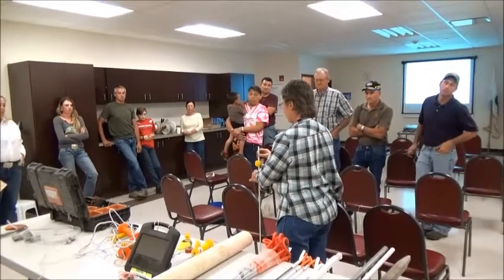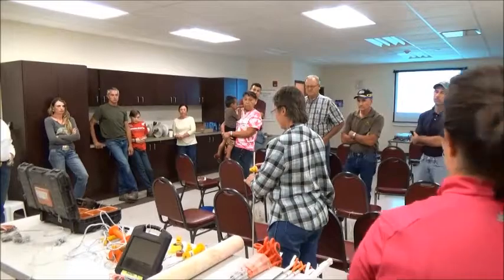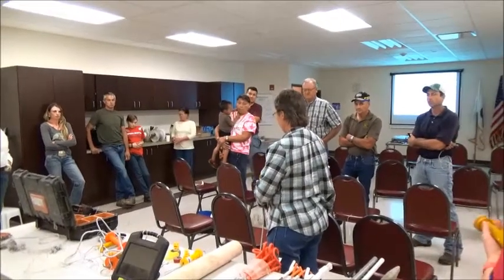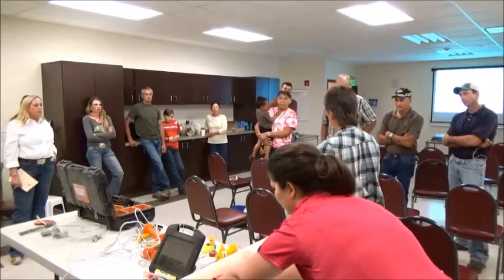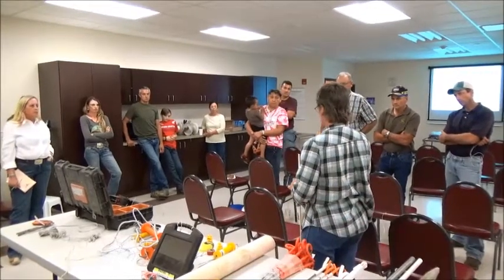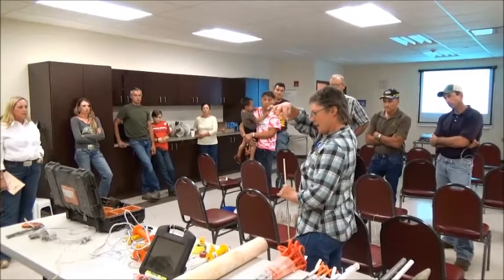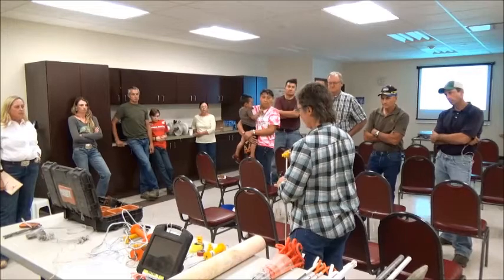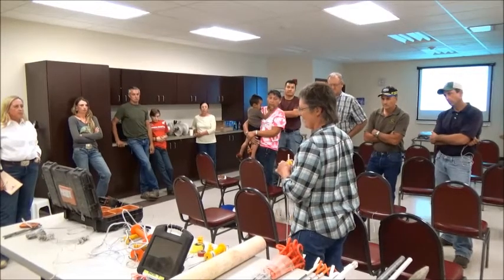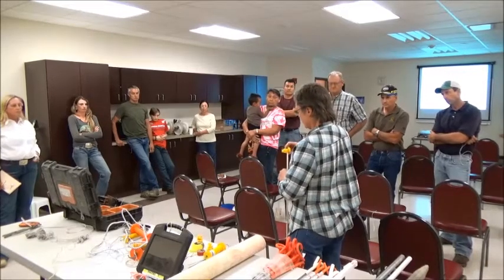This post will put fiberglass slivers in your hands. This here is a cheap Dare insulator. You can buy 25 for $5. It's handed. You might not think so, but it's got a solid side and it's got an open side. Okay, guys, be efficient. Always put the insulator on the same way. Don't put some of them upside down and some not.